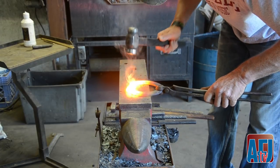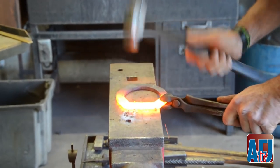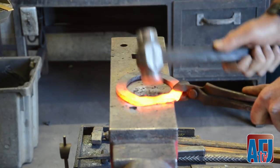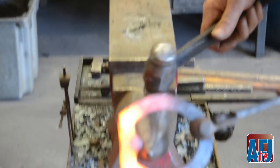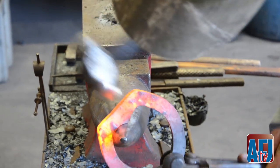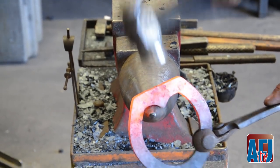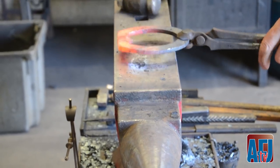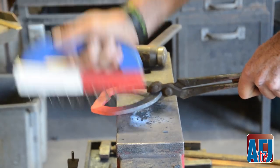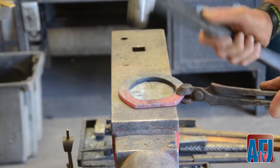Welding for the second time - more flat blows, flattening blows. Then I'm going to come in here with the round side of my hammer and make a clean-out for the frog so the shoe kind of cleans itself out. Now that I've got that, I can come and tighten up that frog plate on the side. I'm using the horn to shape the back of my frog plate, and I come in here and hit the same plate and make a nice stop - a clean-out for my frog plate.